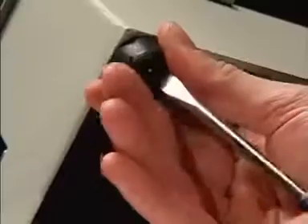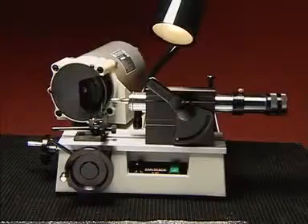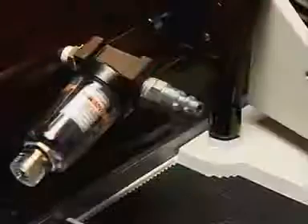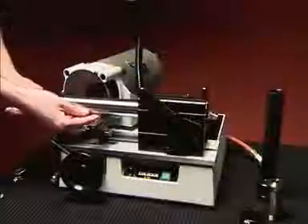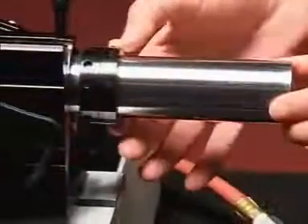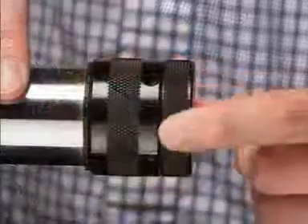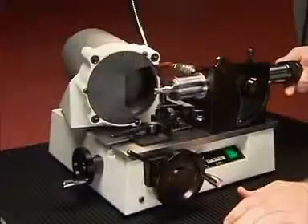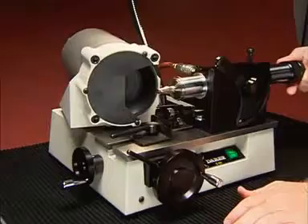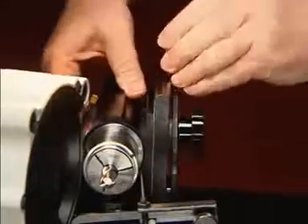A few simple steps are needed to set up your Derex. First, install the air spindle before you sharpen. Start by connecting compressed air of at least 90 PSI. With the air on, carefully place the air spindle into the sleeve from the front. Then slip the index collar onto the back of the air spindle. Slip the draw tube into the back of the air spindle. Note that the draw tube features a free rotating slip knob, making the air spindle easy pull. Ensure the spindle lever is set so that the air spindle is raised to maximum height.